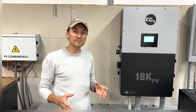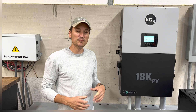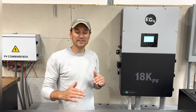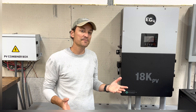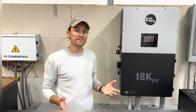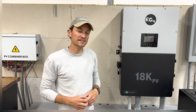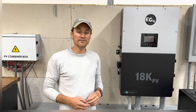So I'm going to do some load testing today at the end of the video and we'll see how much we can push the unit. I'll also try to get it at around half load and see if I can start the AC. My AC is only two and a half ton with a soft start. The well is really my largest inductive load and it handles that fine, so I'll try to include that in the video.